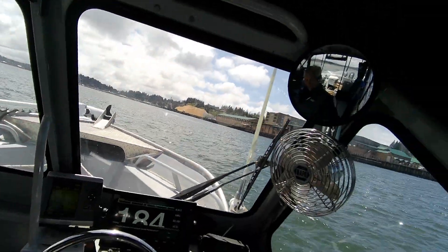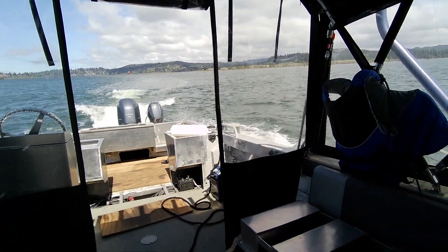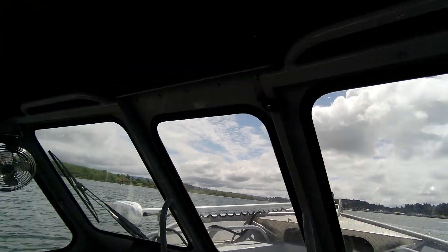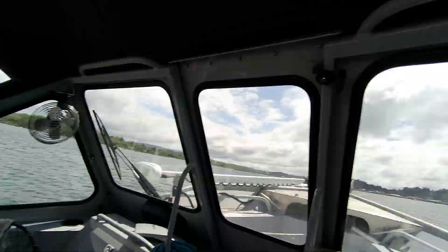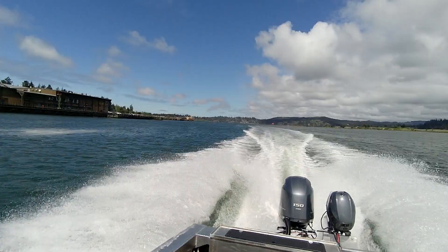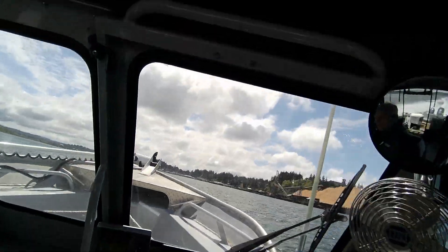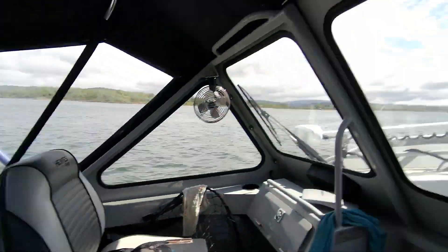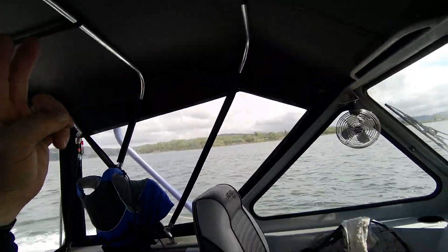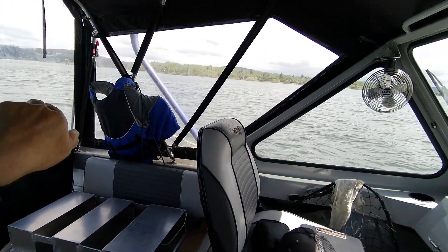And that will keep it from bubbling up through the top and keep that spray off. All in all, it did pretty damn good. I'm going to trim these back up again and hit this again. It's just really clean right there. When you start to plane it — yeah, coming up through the back. That can be fixed easy. For home building, it did a pretty good job. He's getting water flow, doing really good. It's just, once he planes it up on top, that water is going to be shooting up and hitting, coming up through the bracket of that motor. But on the back, you can put a plate that comes straight out a little bit, and that will deflect that water out so it doesn't do that.